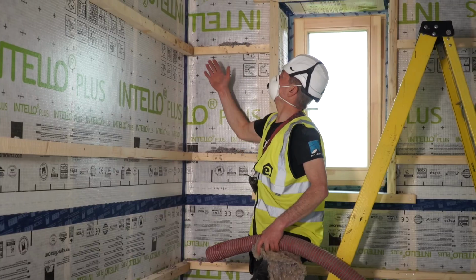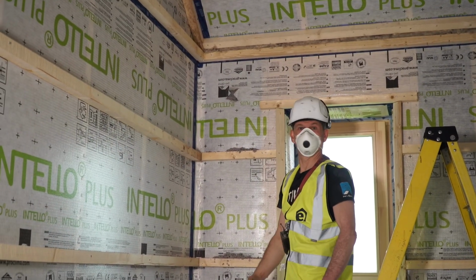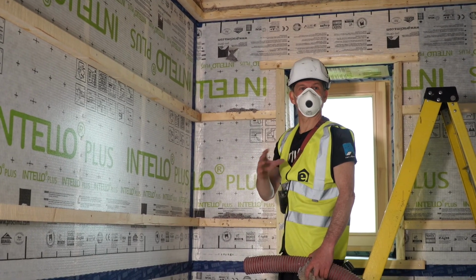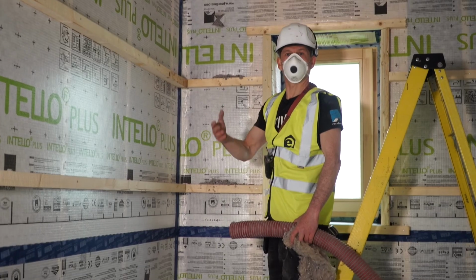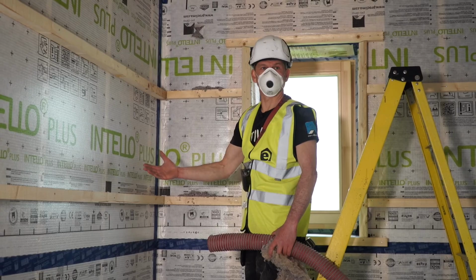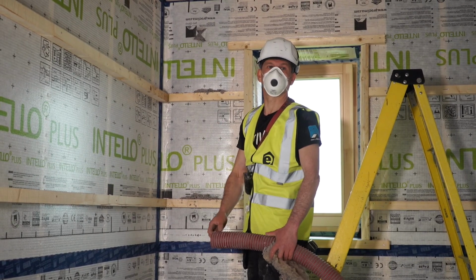And that way you would just continue on now. Cut a hole, bring the hose in, repeat, repeat. And in between, you always do that quality control where you calculate the material used versus the volume that you filled to make sure you stay at the density that you aim for.